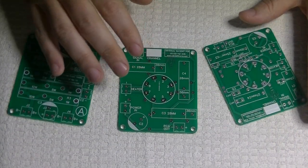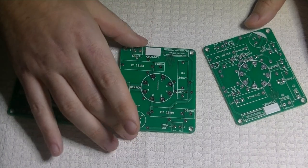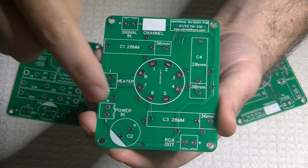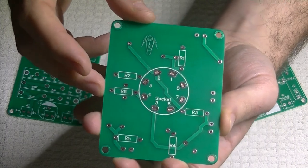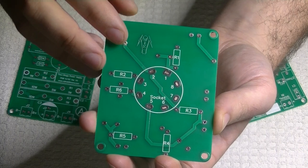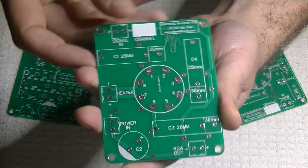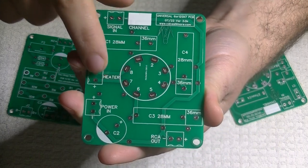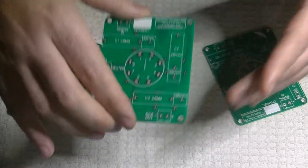With the rest of our boards, we've come up with basically two different standards. We have our actual kit production boards, which are a simplified layout with lots of spacing around the components, way less complicated looking. These we designed to be as easy to build on as possible, as well as having all the great benefits of an isolated signal path — keeping the heater traces away from anything, especially the signal, as well as the B+ away from everything.